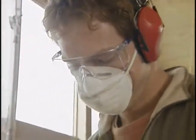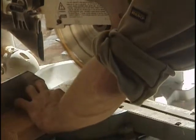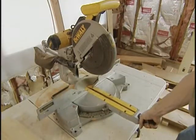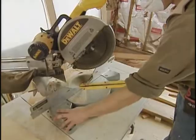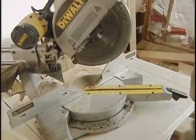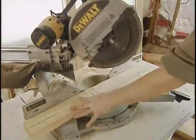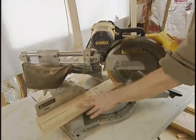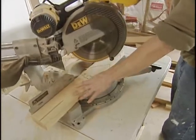When it comes to miters, both the miter saw and table saw are far more accurate than anything you could produce by trying to guide a circular saw along a pencil line. On a miter saw, cutting an angle is a matter of setting the table to the desired angle, tightening the handle, and making the cut. There will be several angles, including 45 degrees, at which the saw clicks into place, simplifying adjustments. As long as you set the saw to make an accurate 90-degree cut, the angle settings and stops should be accurate too.